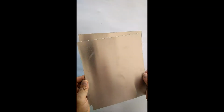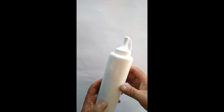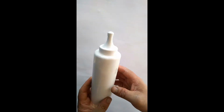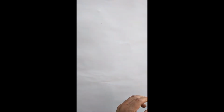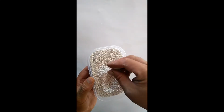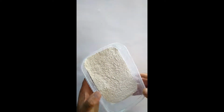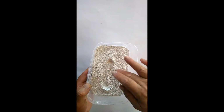We show to camera all the material and accessories that we used for the realization of our samples. In the first place, aluminum sheets of 25 by 20 centimeters, with a thickness of 0.6 millimeters. Then we have a can containing rubber, which we use as primer, a way for our materials to grip the support. Now we show you the microporous technical grain. Its color is white and it is the technological base of the system.